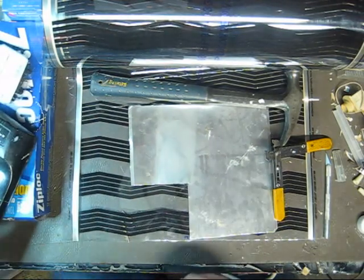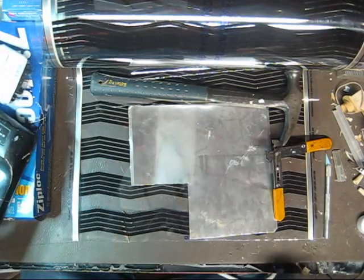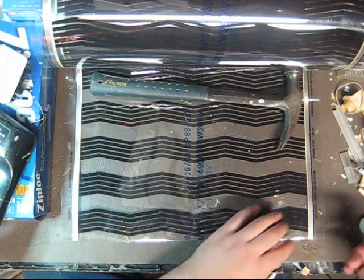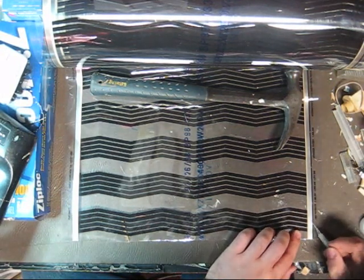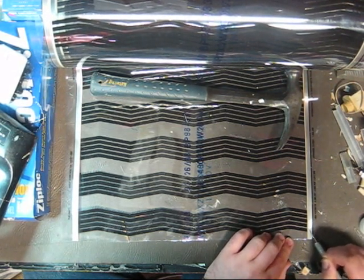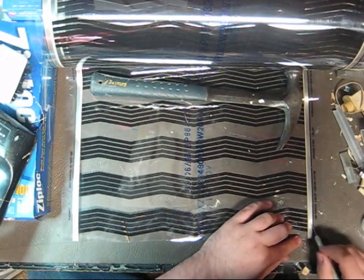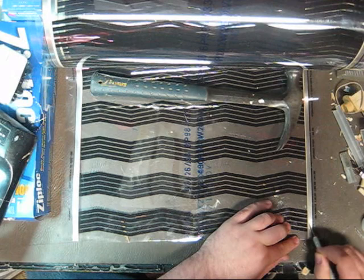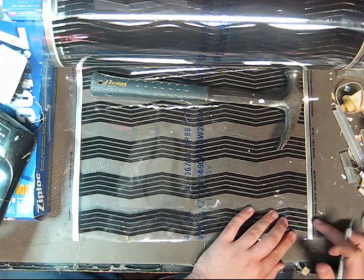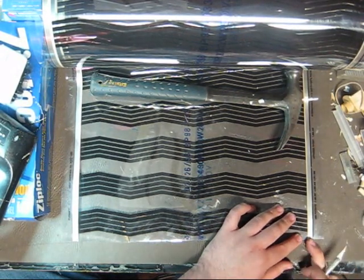Now once you've done that, you have to prepare your FlexWatt. I'm using the X-Acto knife here to scrape some of the plastic coating off — just enough space to solder on the end of the extension cord. This plastic is pretty thick so you gotta work at it a little bit. I'm doing it about a centimeter in from the edge, so I can wrap some tape over that to insulate it — not right on the end.